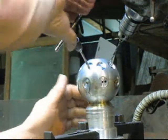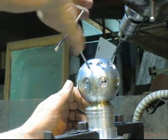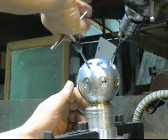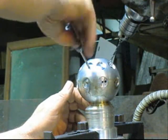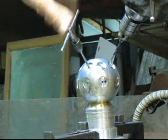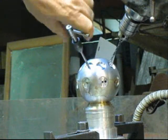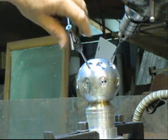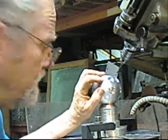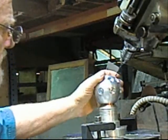So we've got the holes drilled. Now we're coming in with the tap and threading the holes so that we can put the little screws in to hold the magnets in. Pretty simple. I've done about four of them so far and now I'm on number five or six, moving forward. Okay, so we've got the holes drilled, we've got the holes tapped, and we're ready to go on the top side.